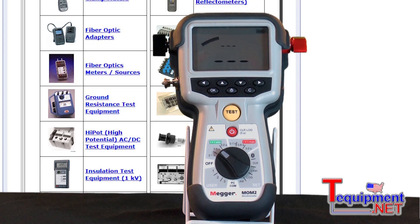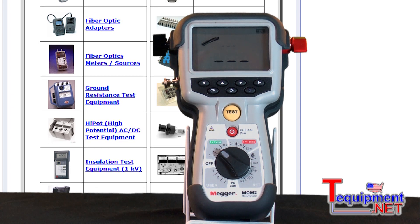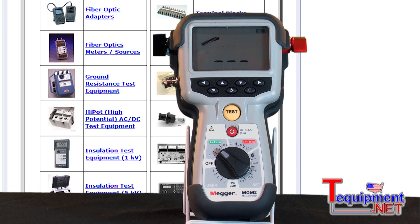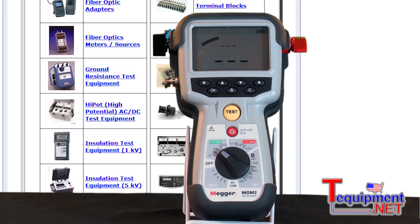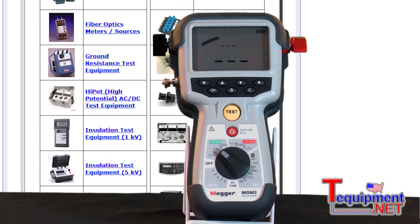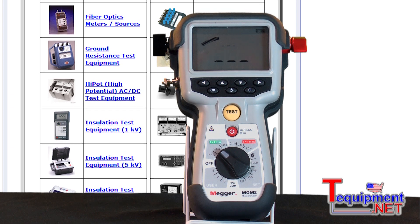As you can see by the selector switch, there's a green zone and a red zone. If you put it to a test in the green zone, the capacitor is fully charged when you do a test and then slowly diminishes or decays down to a preset current that you've selected. In the red zone, after you do a test, it automatically charges the capacitor after every test so you're getting 220 amps every time.